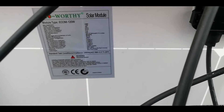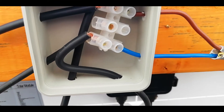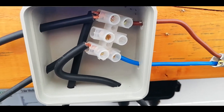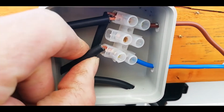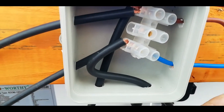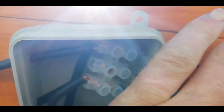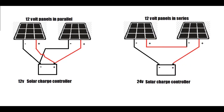For the next step of the project, we're out at the back of the solar panel array. As I go up to the combiner box just behind two of the panels, you can see the panels are joined - two negatives to the blue, two positives to the brown. So now what we're going to do is change that around. It's wired in parallel the way it is now, so we're going to wire two panels in series together - four sets of two panels wired in series.